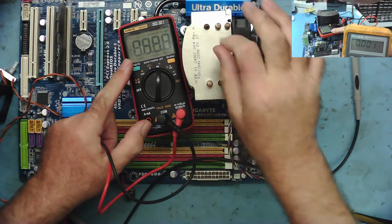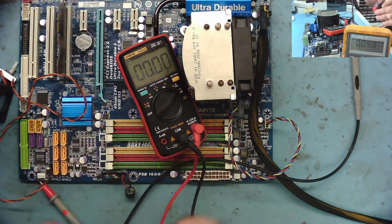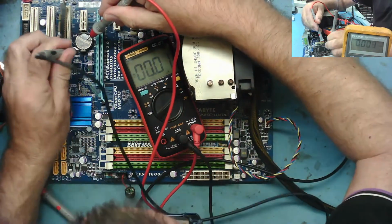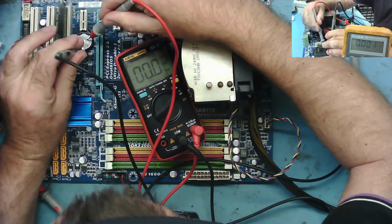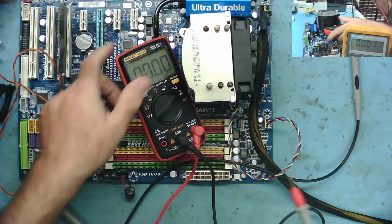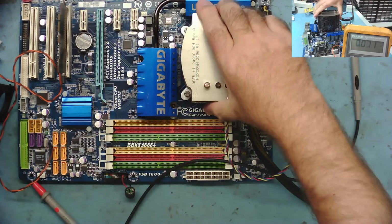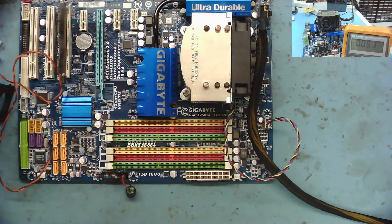So microamps. I'm expecting between 1 and 10 microamps, I would imagine. So positive to the battery, then a negative to the little clip, and push it back, yeah, to break the circuit so the current goes through the meter. 3.8, yeah, that looks good. So real-time clock's running. So put this into position again. Okay. See what it does now.